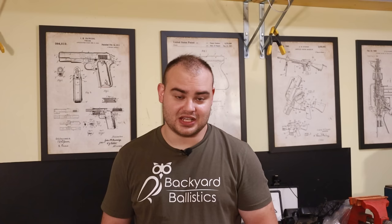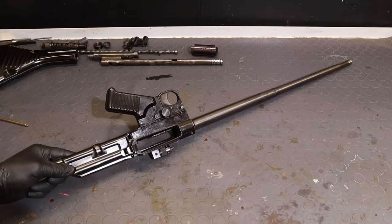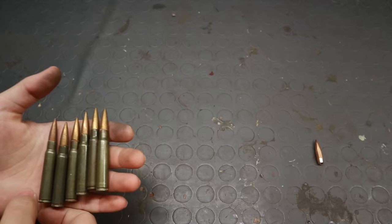Even though this was enough to render the gun self-loading, getting satisfactory performance in full auto was another kind of challenge for the designers. First of all, automatic fire with rifle ammunition produces a lot of heat. For this reason, the barrel walls needed to be thick enough to soak enough heat before overheating. This however meant spending even more weight on the barrel that had to be saved somewhere else in the design. At the same time, the 8mm Mauser cartridge, with its almost 200-grain bullet and high velocity, tends to kick like a mule. On a bolt-action rifle that is not too big of a deal, but if you're planning on automatic firing, some action is required to mitigate recoil, or the shot spread would be the same size as the broadside of a barn. The most common measure taken on light machine guns is adding weight to the weapon, but as we saw for the FG-42 this simply wasn't an option.